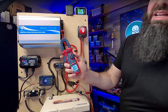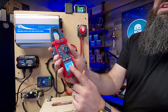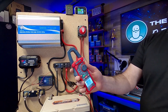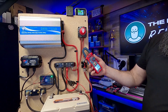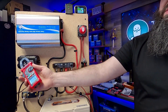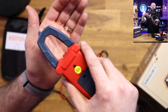If I switch it down to the NCV and Live section — NCV is non-contact voltage detection — you just bring it up to wires. It's really reacting in the studio because there's so much electronics, but as I get it over to a wire that has current on it, it's going to let me know. Same thing with a coil — it's measuring for stray current.